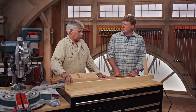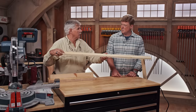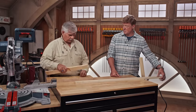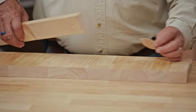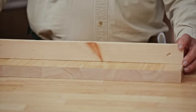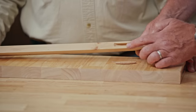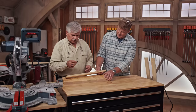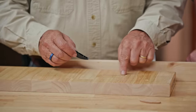But I really don't want to screw it down because I like having a nice flat table to work with when we need it. If you don't screw it down, it's going to move all over the place. Well, we could use a biscuit — put some slots in the table. But a regular biscuit isn't very strong. Biscuits are great for lining things up, but this biscuit here is two parts with a different slot.